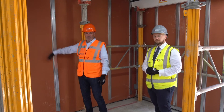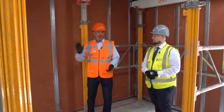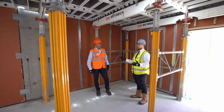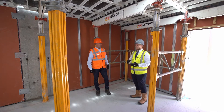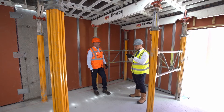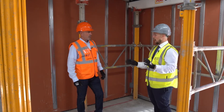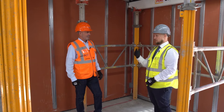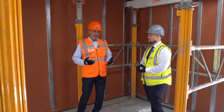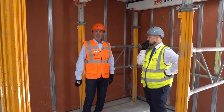This is ready to go — you just need to run your electrical mechanicals from above because there's space between floors, and it all runs straight down, tie it in, close it in. Just one layer of decorative plasterboard and we're good to go. There's actually no more fire stopping to be done in here other than where the MEP comes into the units. They will actually air test this in this state — because it's all factory-controlled vapor control layer, which is the film creating the air seal, all done in the factory. It's so good we don't have to wait for the final plasterboard; they can air test it like this. That's the accuracy of off-site construction — controlled methods. The accuracy saves you a lot of time and effort fixing air gaps and all the things that traditionally you'd have to do on-site.